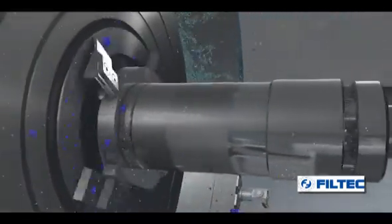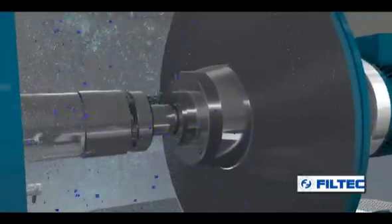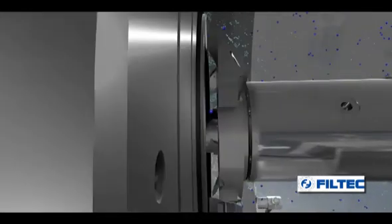The material, fed out of the holes, is cut by the blades and falls into a stream of flowing water which transports it towards the outlet of the granulation chamber.